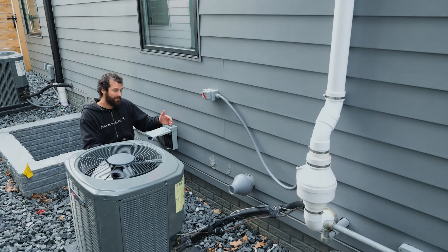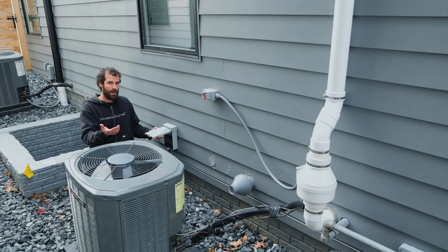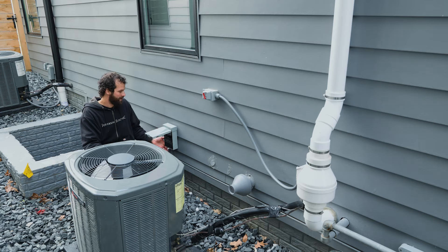If the fasteners are not outdoor rated — if they used drywall screws, which is entirely too common — that's a big problem. I'm a big fan of the T25 SPAX screw with triple guard for excellent durability. If it's just a drywall screw, that screw is going to rust off. I've seen these things come off in my hand without any force at all.